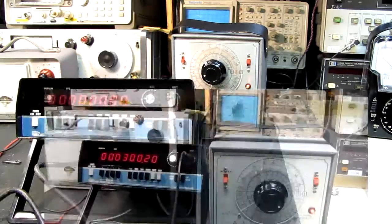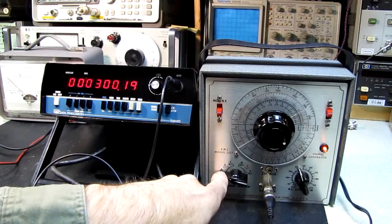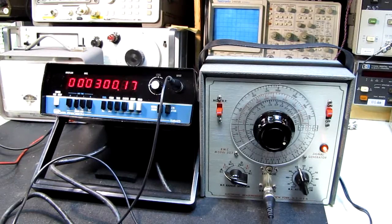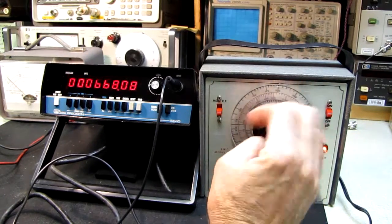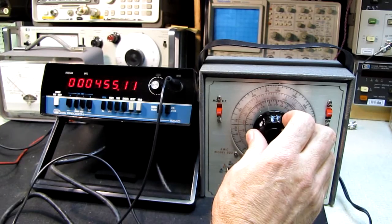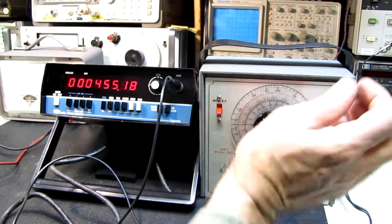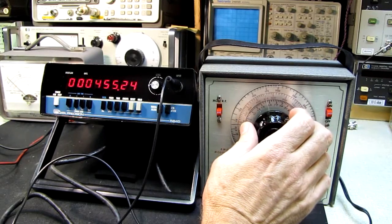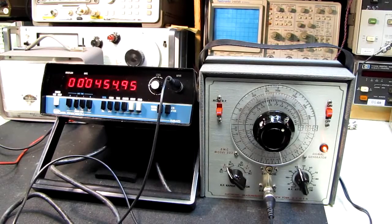This is going to make a very nice combination. I've got our little signal generator on band A, set on 300 kilohertz — and here it is, 300 kilohertz. Let's try 455, which is a common IF frequency — there's 455. There's 458... 465. Perfect — absolutely perfect. You can ignore that 180 hertz; it's not going to hurt your IF alignment one way or another. The IF is broad enough it won't even care.